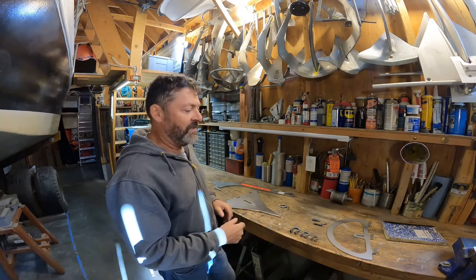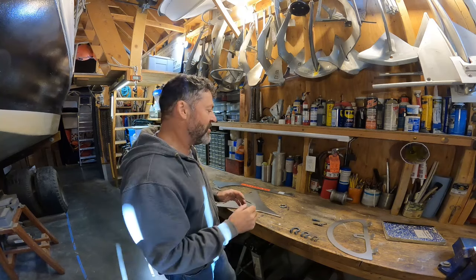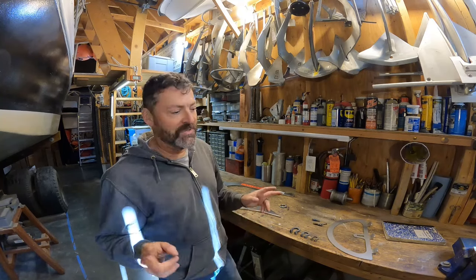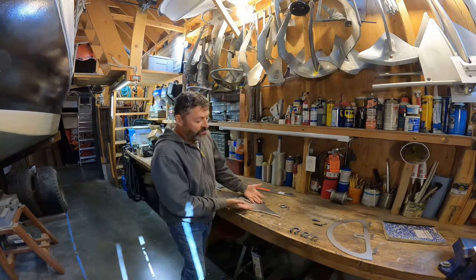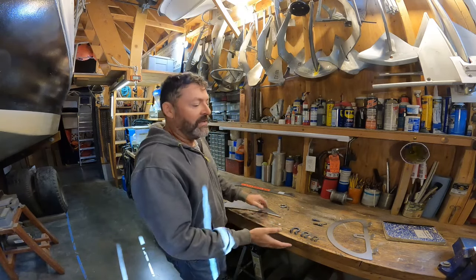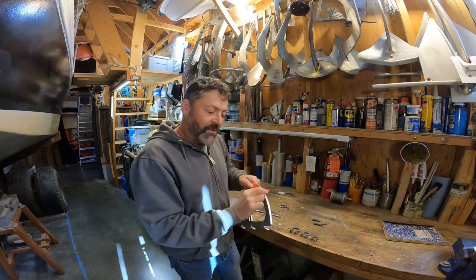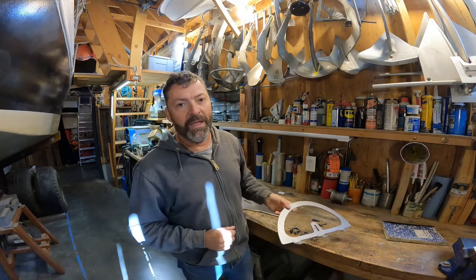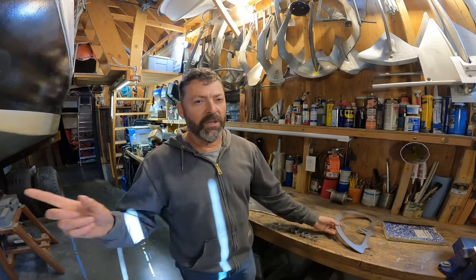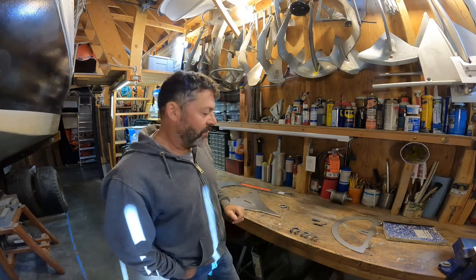Now, the cost of this simplicity is perhaps less than ideal shapes and structures in terms of anchoring. And one thing that comes to mind is without folds in the fluke and dimensions other than this way on the roll bar, you could potentially have weaknesses and perhaps bend the anchor under higher loads. But we'll get more to that as we watch the footage of the anchor in the seafloor.